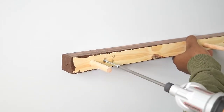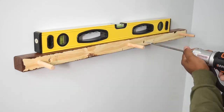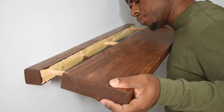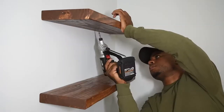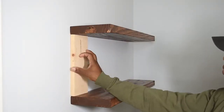Place the wood over the mark you put on the wall and screw into the stud. If you didn't have a stud finder, you'll be screwing these into a wall anchor. Now align the shelves with the dowel pin and slide the shelves into place. Repeat the same process for the remaining shelves and add the safety screw. You could also use a piece of scrap wood to help you space the shelves properly.